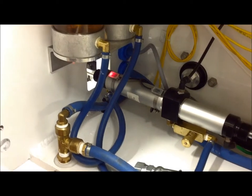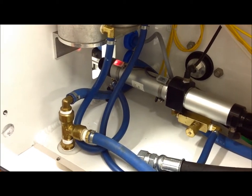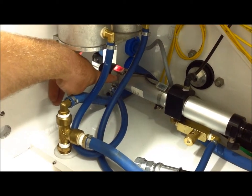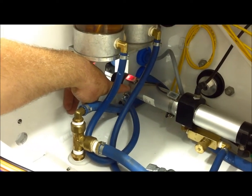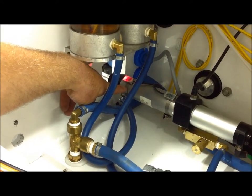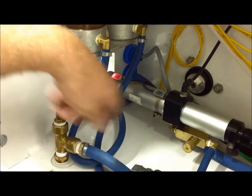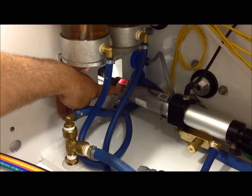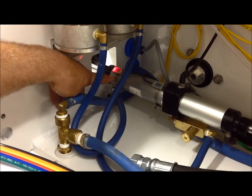Now, we're looking at the passenger side entrance wheel cylinder. This cylinder is actually kind of special because it has a secondary reed switch right here, which reads the inbound motion of that passenger side brush. When that brush goes fully extended, where the 4-inch stroke and the 2-inch stroke of the cylinder is totally deployed, this secondary reed switch will turn on. What this does is start the wig-wag motion in your programming.